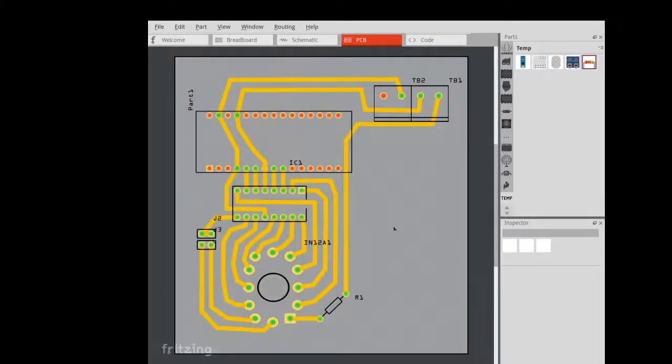This is my circuit, the one I made on my own, and as you can see, it's a lot neater and it looks a lot more presentable than the one I showed you earlier. And I've even added the microcontroller, which is an Arduino Nano, and the power supply unit. So this is now the Russian IC, the K155 IC. Here's the IN12, and you can see I've just connected them in whatever seems like the natural way to do things. So there's no crossover, everything looks neat, but you'll notice the pins are not connected correctly.